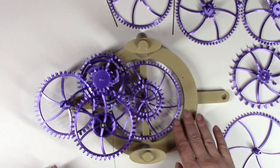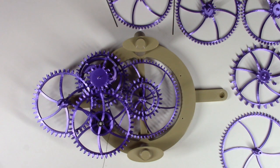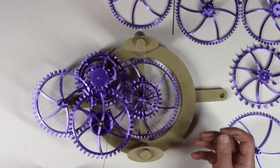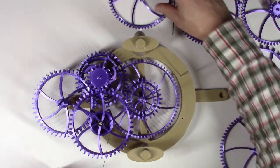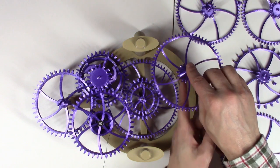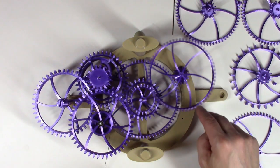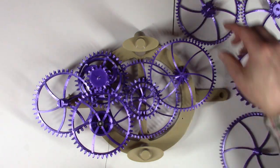On the right side there are a few more gears, and you have to do them in the order shown in the manual, otherwise it gets difficult. Start with an arbor in the upper hole. Gear three goes in with the pinion down so that it engages with gear four. When you rotate gear three, you should notice gear four rotating as well.